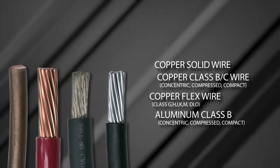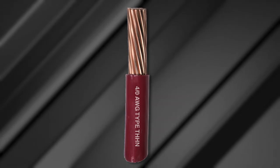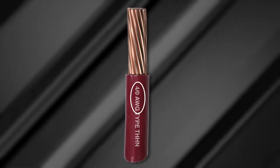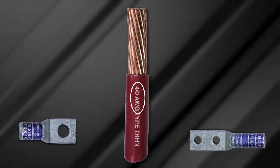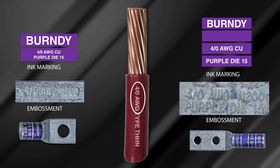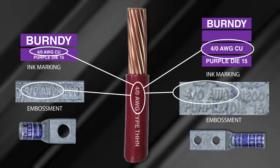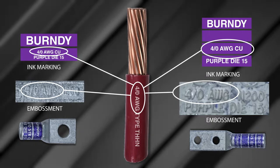Additional wire types include aluminum Class B building wire. Wire size or gauge will determine the physical wire size designation. Once the wire is identified, you can select the appropriate connector. For this video, we have selected a copper Class B 4-ought AWG gauge wire. Installers can verify the proper connector by matching the wire size on the wire insulation to the connector barrel ink marking and the info embossed on the terminal. Burndy color code lugs accommodate both Class B and C wire stranding and have solid color code bands with knockout lettering.